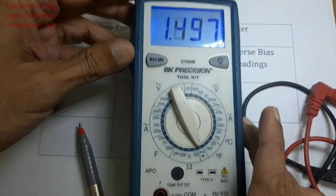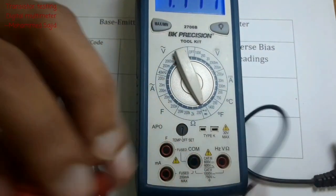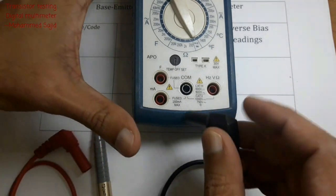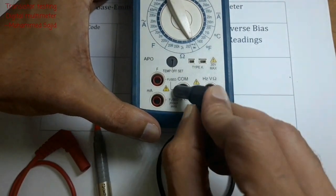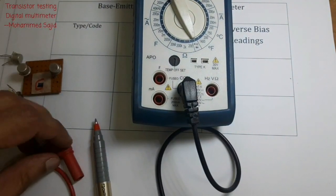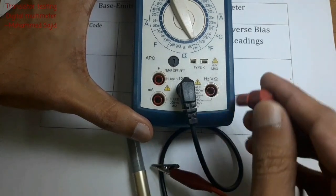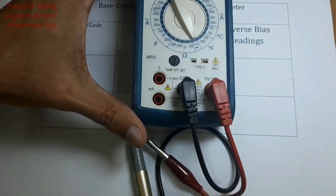D position is now selected. I will take two wires and connect them with the digital multimeter. The black wire always connects to the COM terminal — this is the negative terminal. The positive red wire connects to the V terminal, because we are measuring voltage.